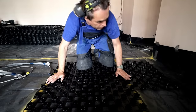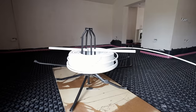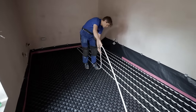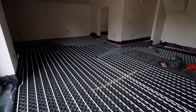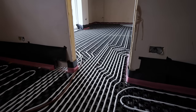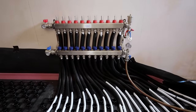You just stick them to the floor on the adhesive. There's no need for very tight spacings on this job — even at 150mm spacing, this job will still run below 35 degrees flow temperature on the heat pump, giving us efficiencies well over 400%. Pipework's done and I'm ready to purge the underfloor heating — we're going to run mains water through all the loops.